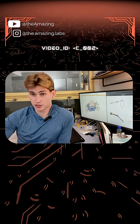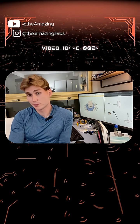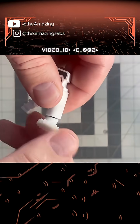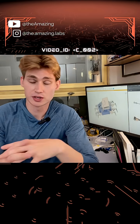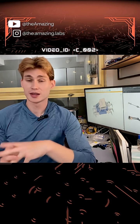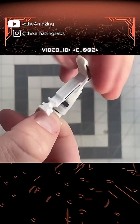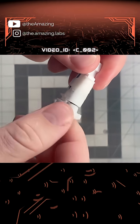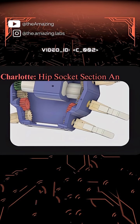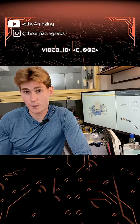You can purchase more of these legs cheaply in case one gets damaged — you just yank it off Charlotte and pop it right back. I settled on these snap peg designs that you see in a lot of 3D-printable parts, though I'm still not super sure if that's going to be the actual way to do it. There are some downsides like friction, and friction already seems to be a component we didn't take into account in the models. I'll definitely take some time to tweak the clearances between the parts to minimize friction.